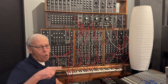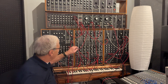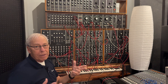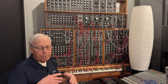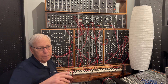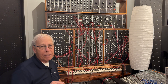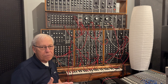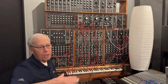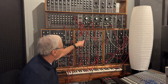So when you hear that wah sound, the voltage is going like this, controlling as I would with a knob — I can go wah, wah — and that is controlling the low-pass function, going from a lot of it to none. That's basically how a wah-wah pedal works. That's just a voltage variable low-pass, band-pass, whatever you're doing, filter that changes its parameters as if you were moving a knob, but the control voltage does it.